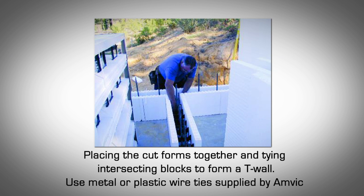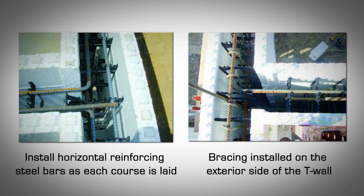T-wall construction. T-walls require special attention before the concrete pour. Proper bracing and alignment are essential. Locate the T-wall intersection as you lay the first course. Cut the AMVIC blocks appropriately and butt them together to form the T-intersection. Use zip ties or the equivalent to secure the blocks together. Install horizontal reinforcing steel bars, including bent 90-degree corner bars with proper lap splice length, as per engineering requirements and/or local building code. Continue stacking subsequent courses of block until the full wall height is achieved. Check walls for level. If the walls are level, run a bead of spray foam down along each side of the forms on the T-wall. For below grade and main floor level walls, additional bracing must be installed on the exterior side of the intersection.